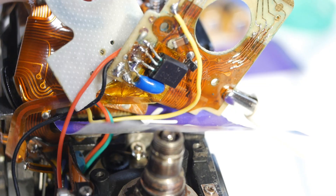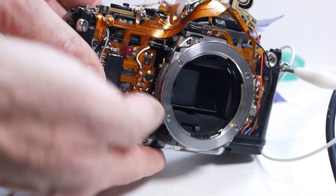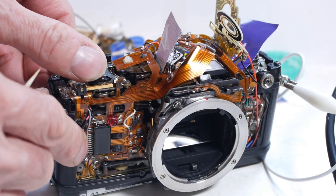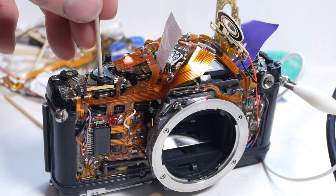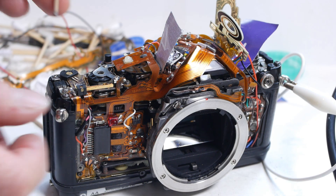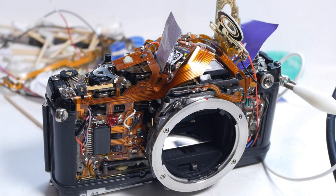Sometimes the power light will come on, and other times it flashes, but most of the time it won't light at all. When I last tried it the light was sort of working, so I'll try it on camera now in the hopes that I can get a clip showing some signs of life. After a few attempts the power LED is on, but if I press the shutter release the motor just winds — it's not stuck or anything, but the chip that controls it is just sending out a high frequency rather than turning it on properly. So possibly one of the chips has died, or maybe it's just a power supply issue which could of course have destroyed the chips already. Whenever I try to use the oscilloscope the camera won't turn on, so I can't get any decent readings. Back to the drawing board.